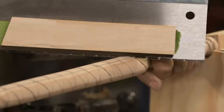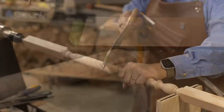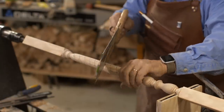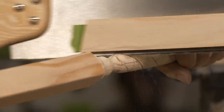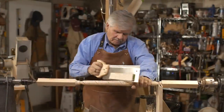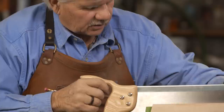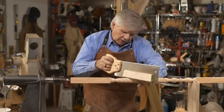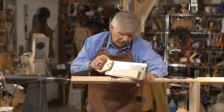The back saw has a very stiff back so the saw doesn't wobble. I also put a depth stop on it that will bring me down to a particular depth so it will all be consistent. You'll notice the hand saw is grabbing every now and then — I'm actually twisting it in the cut, which is why it binds up. I don't want to put too much pressure on it because I don't want to break the baluster.